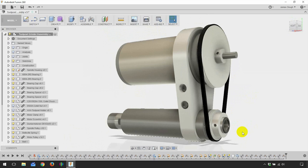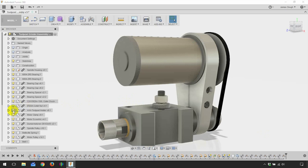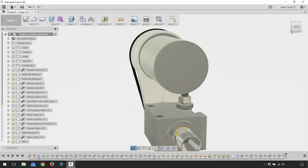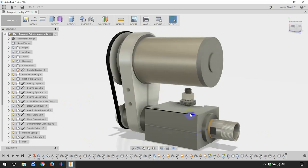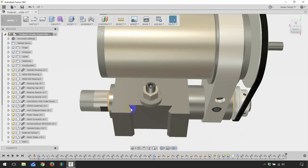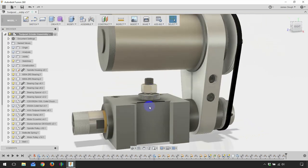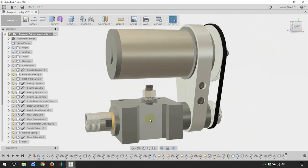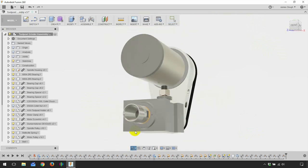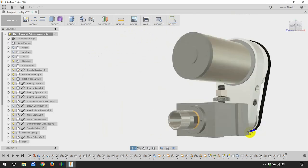To mount this whole thing onto the lathe I need a way to clamp the spindle. I have an AXA tool holder on the lathe, so I opted for an AXA tool post clamp — a block bored out to accept the inch-and-a-half spindle, split with a couple of screws to clamp it down. On the back side it has the geometry for the AXA wedge-type tool post, so it drops right under the tool post. It's got a height adjuster on a set screw with a lock nut and a little wave washer to allow height adjustment. As we measured on the lathe, we've got about a hundred thousandths between the bottom of the spindle and the bottom of the block, so it should all clear over the top of the top slide.